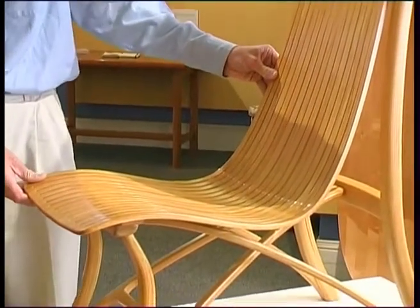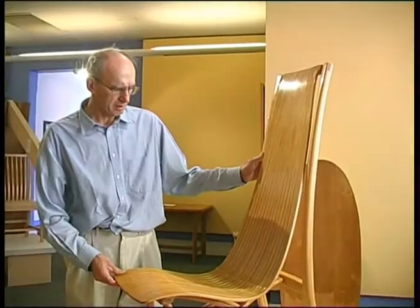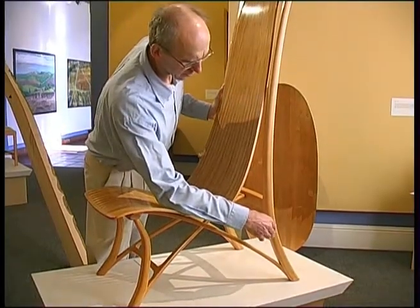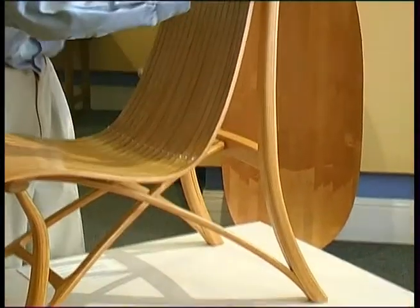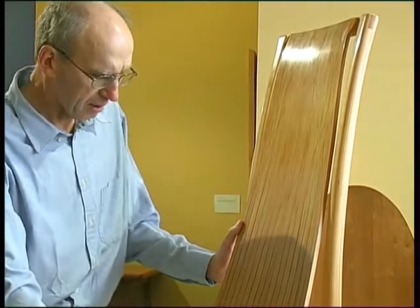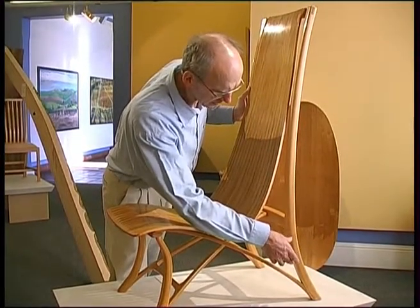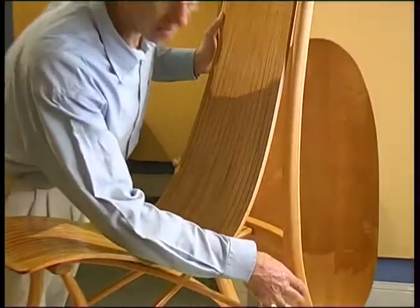Here is another chair, very similar to the one I described earlier, but quite a few factors make it different. The first one you saw was the prototype. This chair here was, let's say, the production model with some quite major alterations which may not be initially obvious to you. These legs on the production model are much wider apart at the bottom and closer together at the top, giving, I think, a more elegant appearance to the whole piece. While this cross member here, linking the two rear legs, is a good deal higher off the ground than the prototype, adding more strength to the basic structure of the way that this design functions.